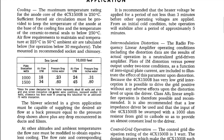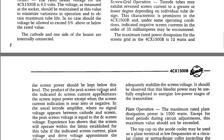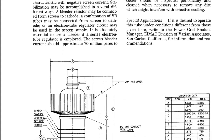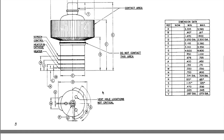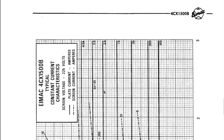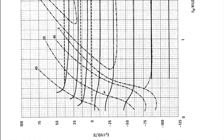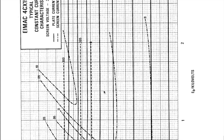Since the power dissipated by the heater represents about 60 watts, and since the grid plus screen dissipation can under some conditions represent another 13 watts, an allowance has been made in this tabulation for an additional 73 watts of dissipation. You can look this up online — it's a pretty stout tube, made for continuous duty, operating from a command ship such as a carrier or battleship. Even smaller ships would have had this same transmitter. It entered service in the late 60s and continued in service into the 2000s.